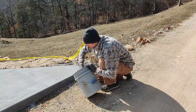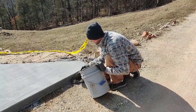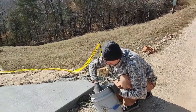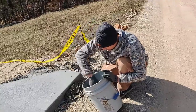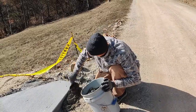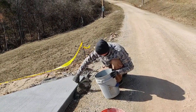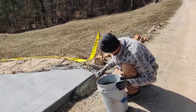What we're going to do is mix — my mix is not real runny, so it has what's called a low slump. We're going to see if our measurements of how many bags of concrete we have will even get close to what we need. After this, we'll go back in and smooth it, but we need to let it have a little chance to start setting up.